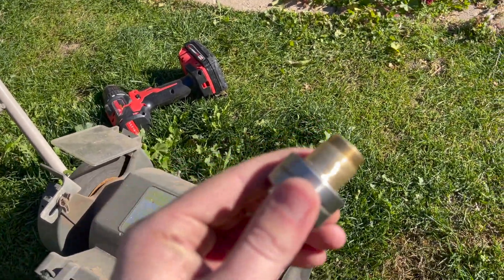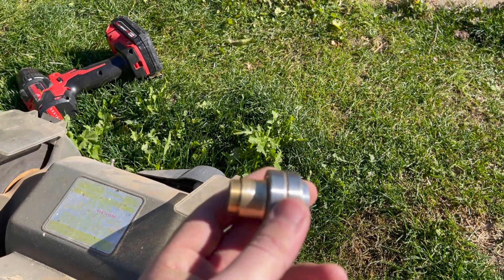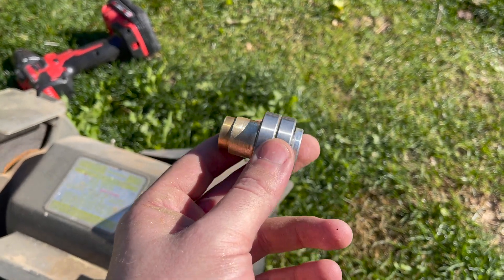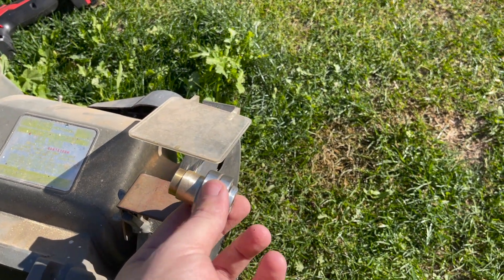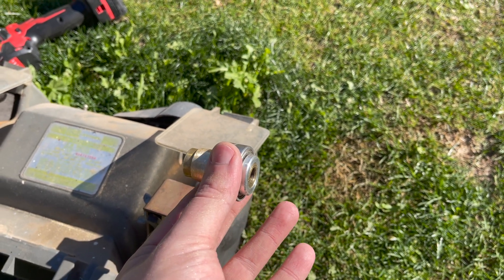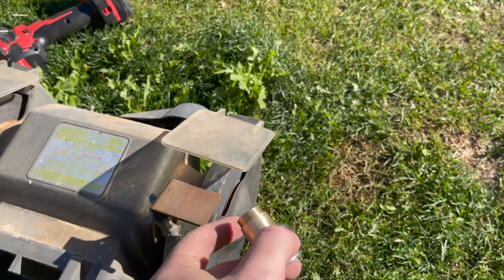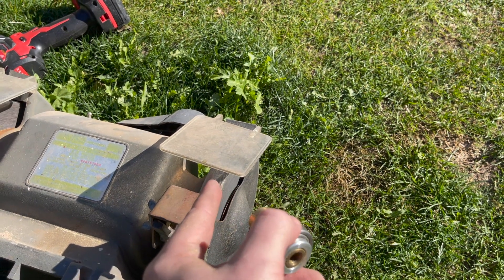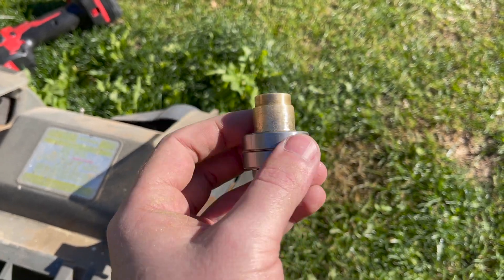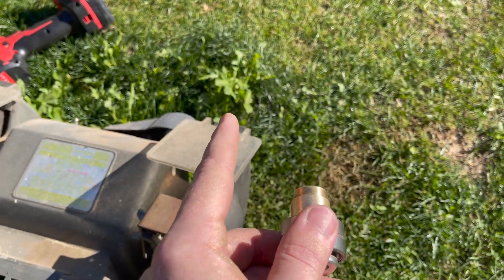With the bench grinder method it works perfect — just do it a little bit at a time. I found it was really important to get the threaded rod really tight using a wrench so it wouldn't vibrate out. I ended up not even using the drill; just hold the end of the threaded rod and give it a little flick with your fingers and it'll start rotating — not as fast, but it gives you a nice even grind all the way around.